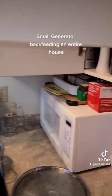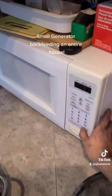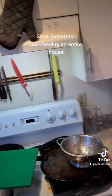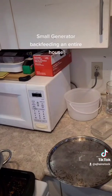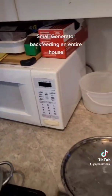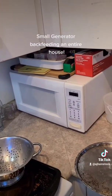We'll throw on that microwave and let's see if this microwave trips the generator. She struggled a little till the generator kicked up speed. But I think in the event of an actual power outage, I'll just take the eco mode off and let the generator run full throttle so it doesn't have to try and throttle up while producing more amperage.